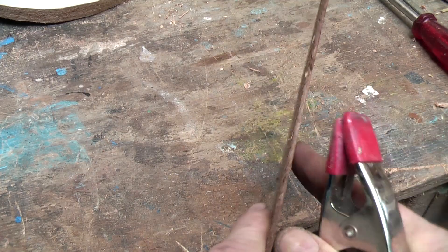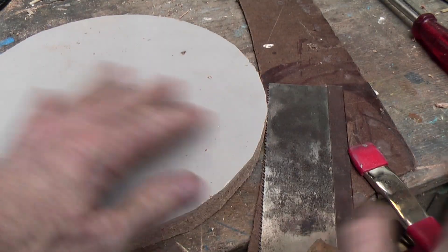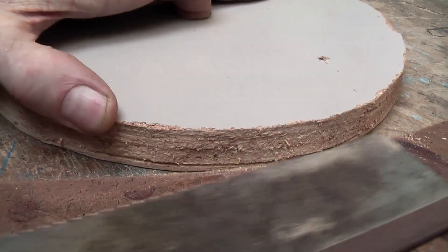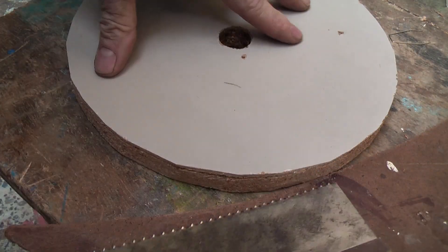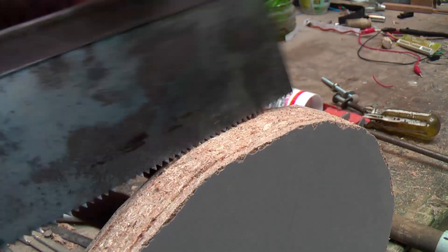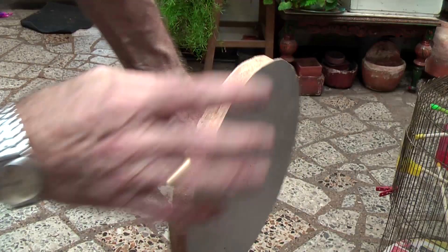Now we are going to turn this into a pulley. I am going to get a piece of board about a couple of millimeters thick, clamp it at the table, put the wheel on that, and then run the saw on top of the board to score a line right around here, then flip it over and do the other side. Then with it back in the vise again, I am going to take my saw, put it in that groove and cut a 45 degree from both sides to cut that V out of there. Then clean it up with some sandpaper. So there we have our pulley.